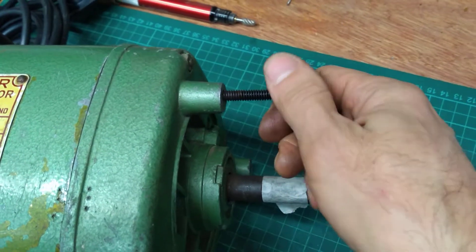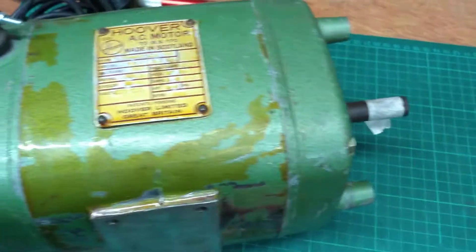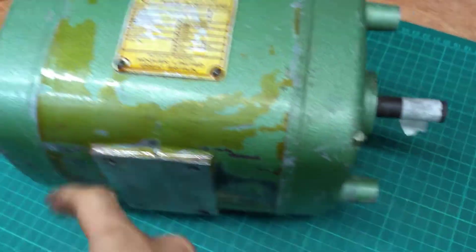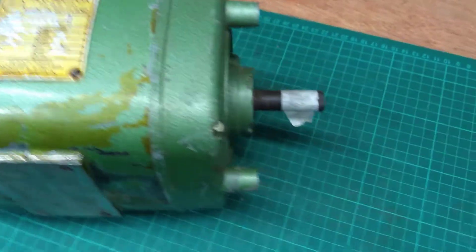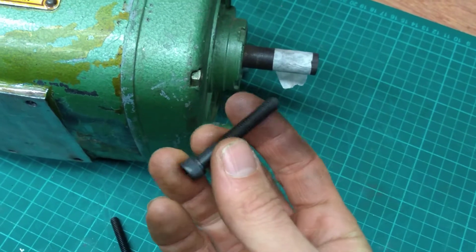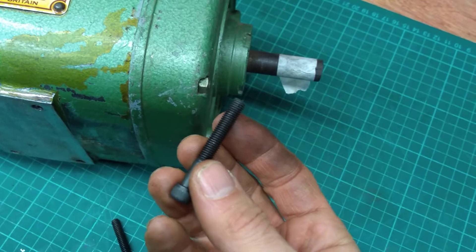Wrong — it binds up. That's not quarter-inch Whitworth, which sort of caught me out, because I would have sworn they would have tapped it the same — unless someone has re-tapped this, which I can't rule out. Anyway, my next guess was quarter-inch fine thread, so BSF thread.